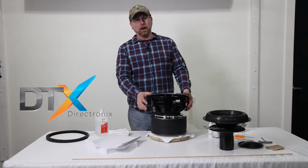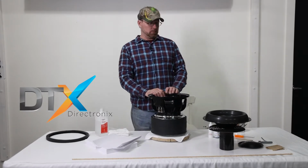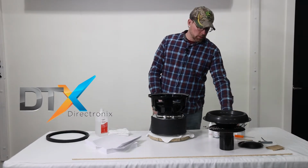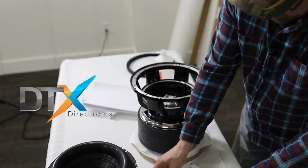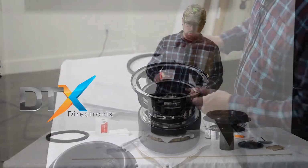I'm going to show you how to recone. New video. I know we did one in the past, but now we have our own glue kit, which you can purchase off the website. It comes with a CA and an accelerator. Also comes with a little bottle of rubber glue, which is used for some of the stuff here.